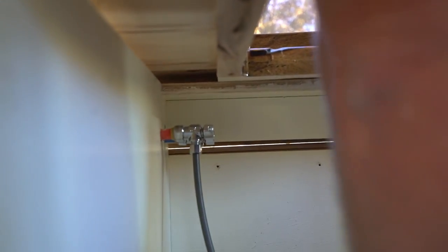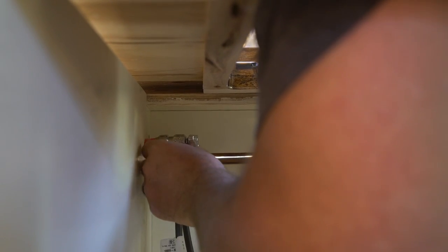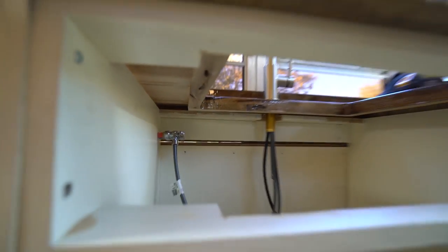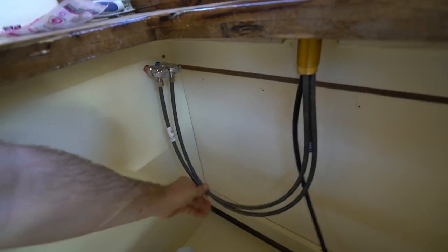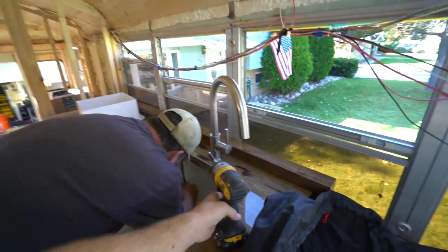Walk us through what you're doing. Just connecting the water supply lines — hot to hot, cold to cold. I can't tell you how many houses I've worked on where the plumber has reversed these things. The left side is supposed to be hot, and I can't tell you how many houses where the right side is hot. I install the sink and the client says it's backwards — crawling back in again. These little hoses will be hidden behind the sink. That's a really good looking sink — it's going to be a pretty sexy skoolie kitchen sink.